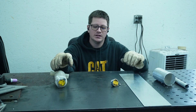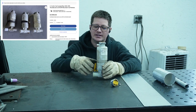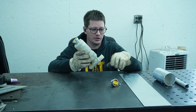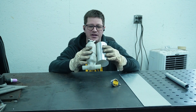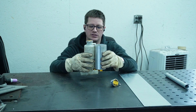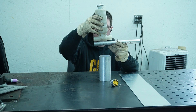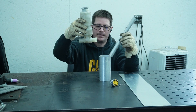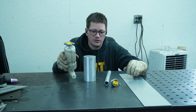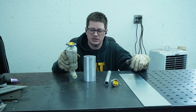I looked this up and the OEM replacement is a hundred and eighty-five dollars for this piece of plastic. So I'm going to take this three-inch tube and make a larger-volume body. It'll hold a little more liquid. Then I'll cut this one-inch tube to make the outlet pieces, and this flat plate is going to be used to cap the ends.